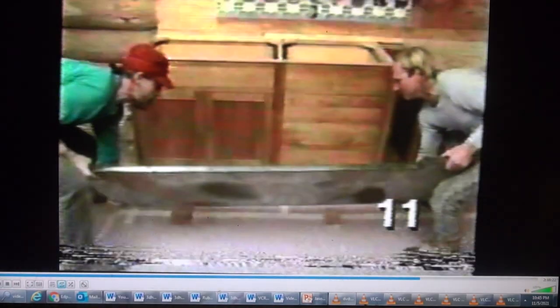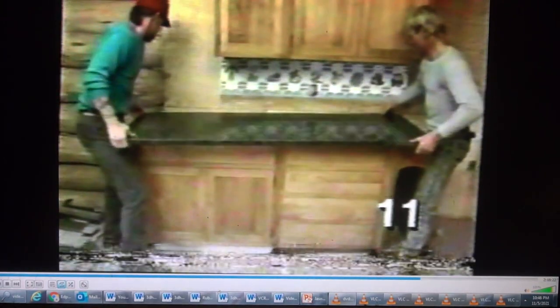To secure it, they first spread glue over the base cabinets, then set the sheet in place. We had to remove the taller end cabinet to get the granite in. It's heavy, but it's strong and stain resistant, which minimizes upkeep. It's tough to get an exact fit, so some maneuvering is needed. The granite backsplash is set over the top and glued to the plywood, fitting right under the tile.